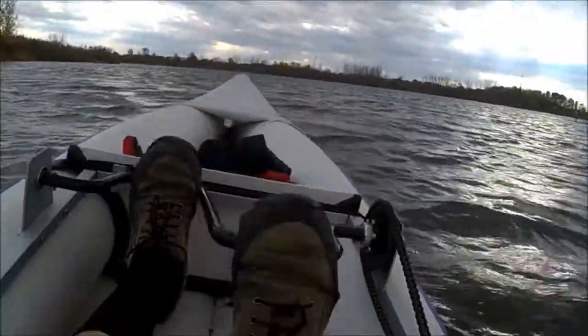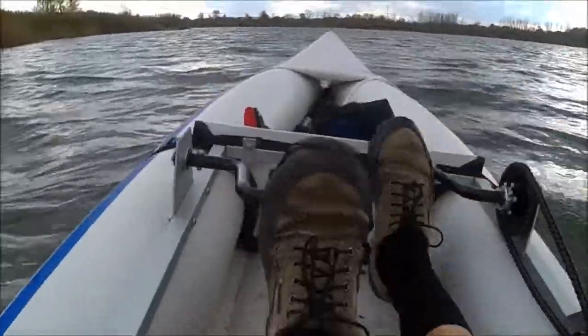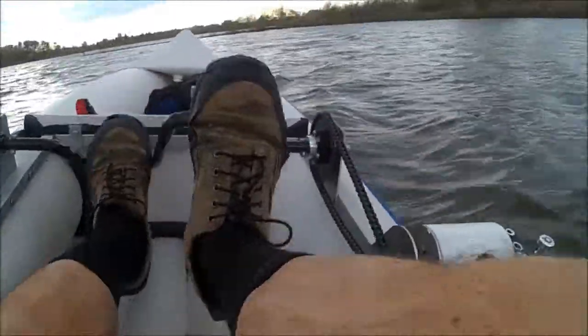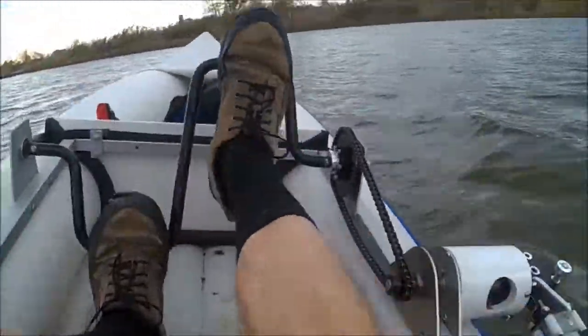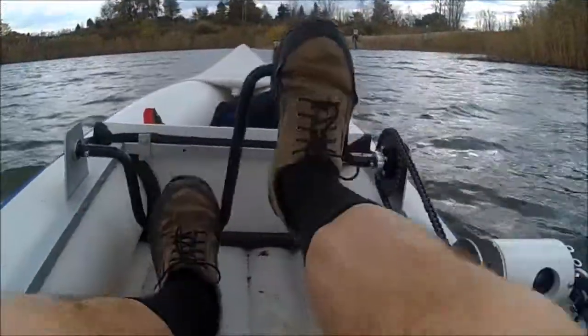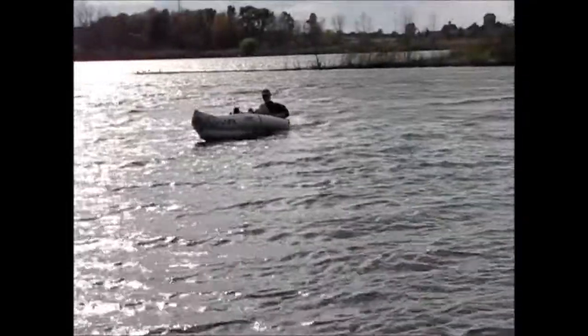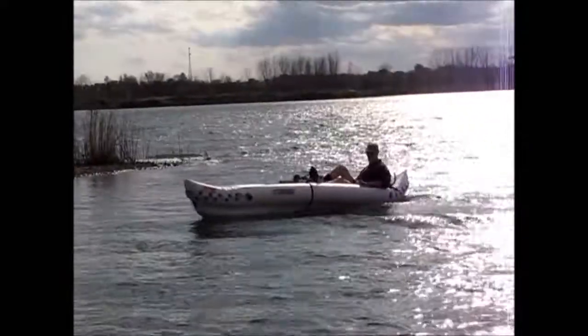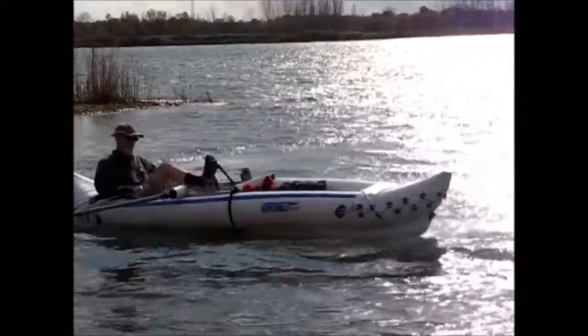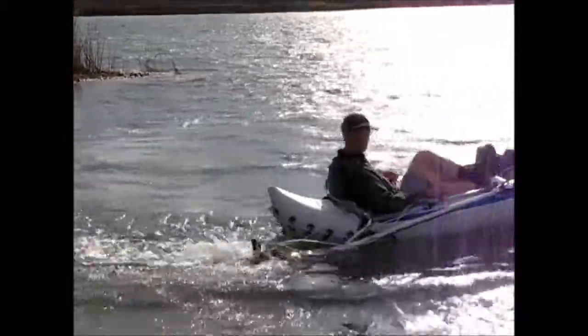In this point of view, you can see the water is a little choppy, but the track is still straight with no side to side motion as with paddling. My hands are also free to use the camera, unlike with paddling. Turns are quick, easy, and continuous, even as I turn 180 degrees downwind. The continuous force of the propeller against the rudder makes the boat act like it is on rails. The rudder is controlled by pull-pull cables connected to a lever near the operator's hand. The close-coupled propeller and rudder make for quick, responsive steering regardless of your forward speed.